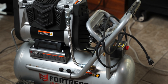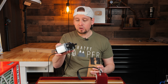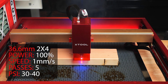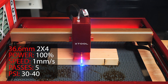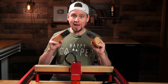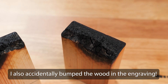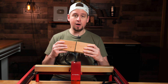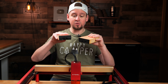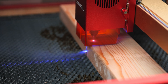If I had my compressor hooked up to this, I guarantee I would have cut through it. We are going to cut through this — the extra PSI is going to help me. If my calculations are correct, the built-in air assist is a little over 4 PSI, and now we are running 40 PSI. We had a clean cut at three passes with the upgraded air assist. However, I had five passes turned on in Creative Space and you can see the charring that happened inside the 2x4 — that is my fault for leaving it at that many passes. This far exceeds my expectations, as you can see the one-pass results on 18 millimeter and 20 millimeter pine board, and this is 36.6 millimeters thick. I do not recommend trying to cut through large materials like 2x4s with this laser — this is simply shown to demonstrate the full power of the 40 watts so you can respect its capabilities.